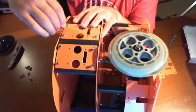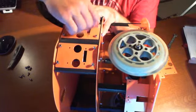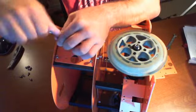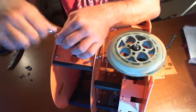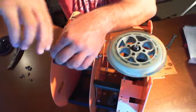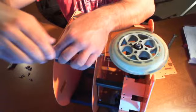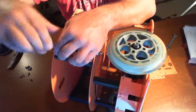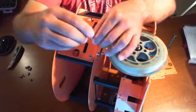With our own personal projects, as we've talked about in the past, rather than putting sensors everywhere, we put a pan tilt mechanism with a pseudo robot head, which has a series of sensors. Our sketches, or software or firmware, whatever you like to call it, take sensor readings and determine what to do based off of that, moving it around, moving forward, backwards, constantly reading from all the different sensors. It's just a different approach, and it requires a lot fewer sensors.